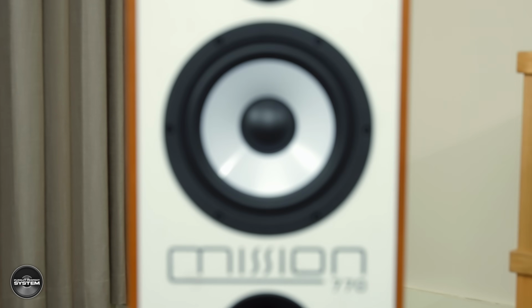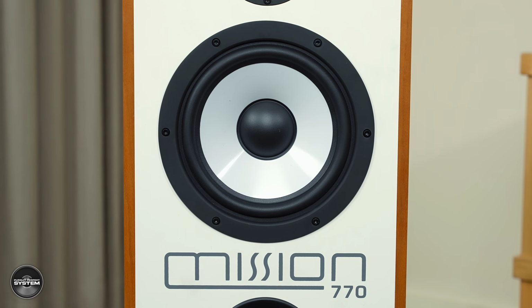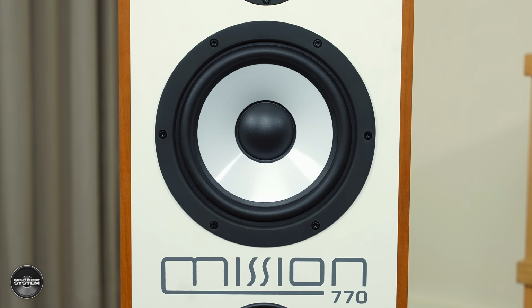As well as that, you'll see the original has a pure, clear polypropylene cone. We can now do a little better than that. We can make it more rigid by including mineral in the makeup of the cone. So this is a more dynamic cone with much more dynamic impact. The voice coil is uprated because the original was rated for amplifiers between 35 to 100 watts. We need to go better now. So much more substantial voice coil system, much more substantial magnet system, still built on a cast frame, but the whole thing is really, really well engineered.